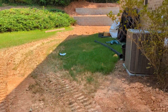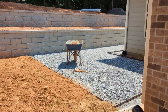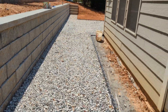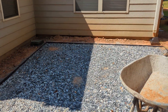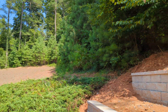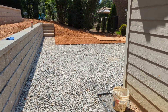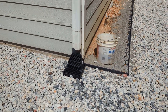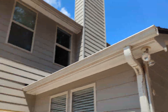This is actually going on the patio back here. The base we use is a 57 stone base, which is also permeable — 57 stone has a 40% void ratio, so rain goes straight through it. We chose this product because they've had a lot of water coming off this hill and there's a drainage easement back here, so we wanted to permanently alleviate all drainage issues. We also put in a new sliding glass door, and all the downspouts have three-way rain lids that filter out all the trash that comes in from the top.